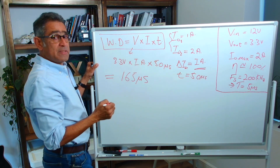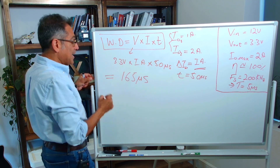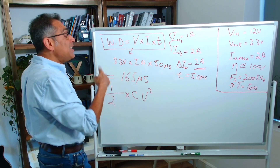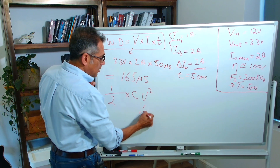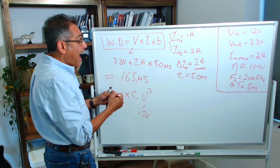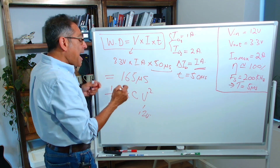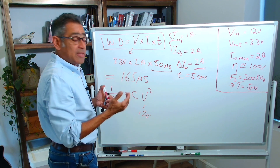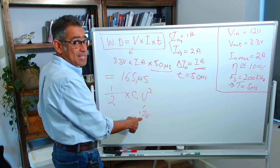This equation can be found in high school physics books. We also know from school-level physics that the energy stored in a capacitor is ½CV². Initially I have 12 volts on the input, so the energy stored is ½ times C times 12 volts squared. How much am I going to allow it to dip? I'm saying only 50 microseconds, and I need to find a reasonable allowed voltage dip. Let us say I don't want it to dip more than 5% of the rail — so 5% of 12 volts is 600 millivolts.